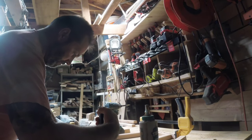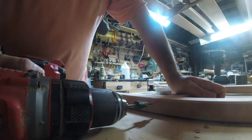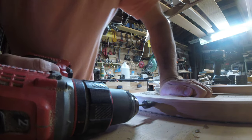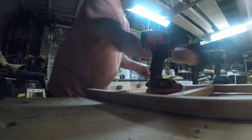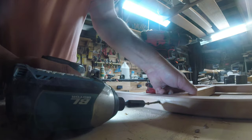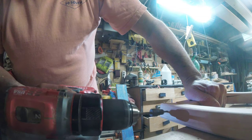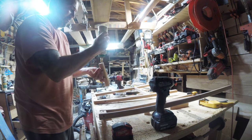I'm going to assemble this — and if you notice, I offset the pocket hole a little bit so I have a little room to put a trim head screw in from the leg end after assembly. We're going to countersink and run a little trim head screw. The good part is it makes it stronger. The bad part, especially with the pocket hole, is I didn't use Kreg screws — I used more of a construction type screw, a little stronger, thicker diameter, a little longer, just so it holds better. The downside is it can split your pine since pine is so soft.